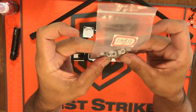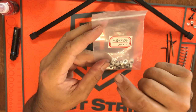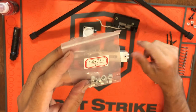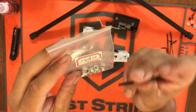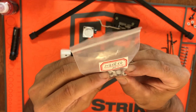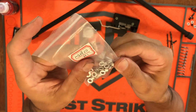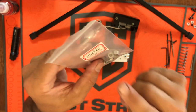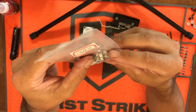Second most important part is these spacers, aluminum spacers that I got from AliExpress. They are 4 millimeters thick, with a 4 millimeter hole, which is as close as possible to the rear Allen head that secures the ASA, which is a 632. And the diameter is 8 millimeters. Now, unintentionally, it worked out really good. That 8 millimeter outside diameter wasn't a variable you could choose. You could vary the height and the hole size, obviously, but not the actual diameter.